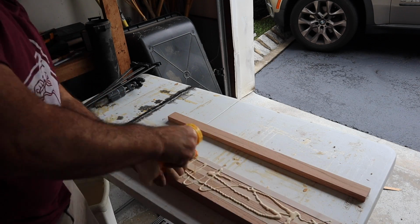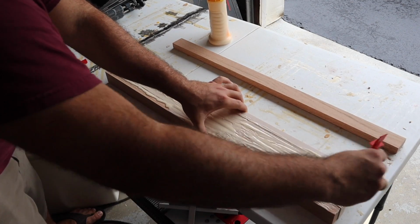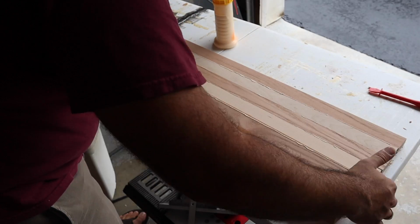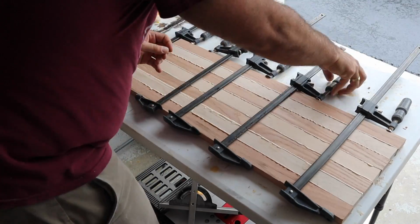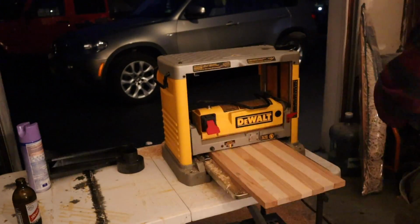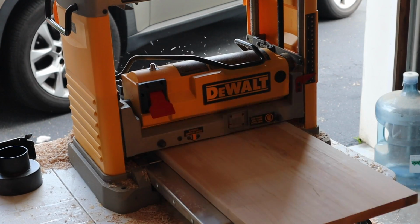After cutting each strip of the flag to length, I glued the long and short length separately so that I could ensure that I could cut off the trim of the edges and make sure it was all lined up before gluing the entire thing together. Gluing them separately also allowed me to plane the stripes and the union on my smaller planer and keep it level.